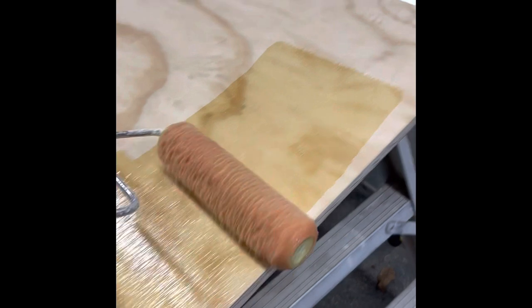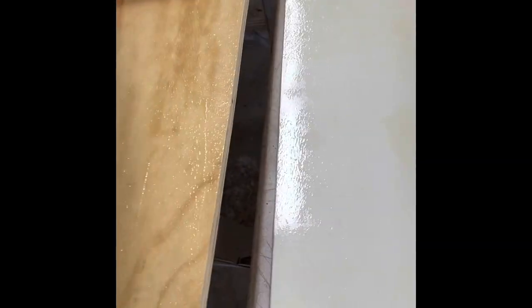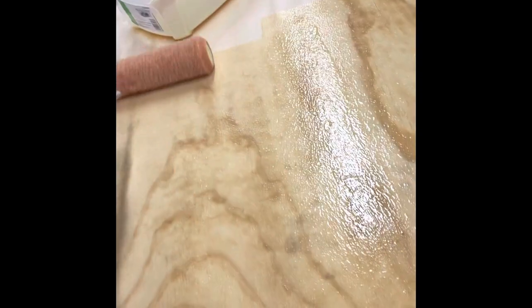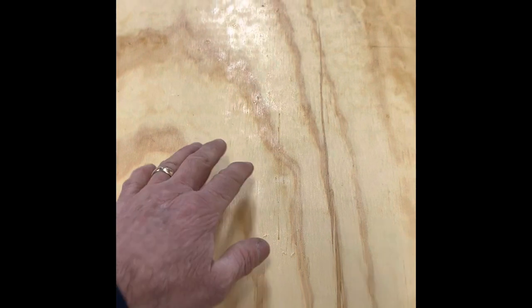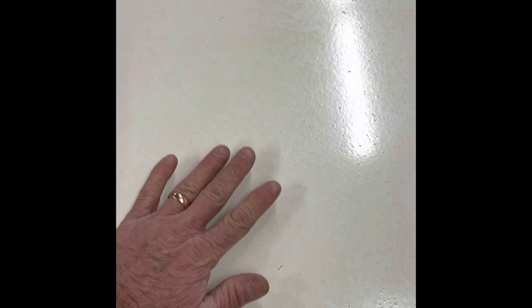You've got to coat one side of the mating part of your plywood as well. If you don't do that with contact adhesive, it will not bond. This batch is a little too wet, but this one is just about right — you can feel just a little tackiness without it being too liquidy wet.